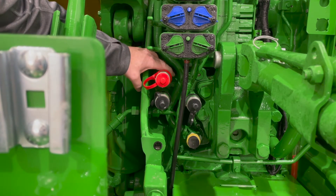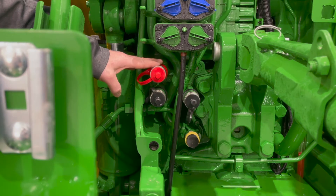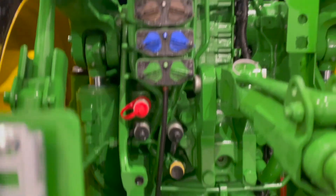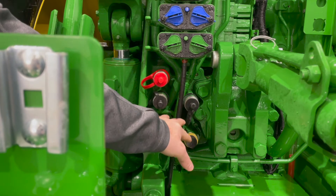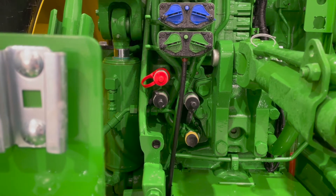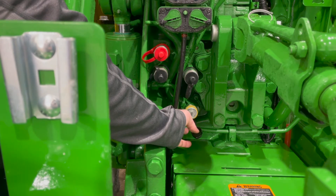Please note this one is equipped with only one pressure port; there is another port and another one could be added — you would just have to get the coupler from your parts department. Please note that your power beyond only has pressure when another SCV is activated or a load sense line, which is located up here, is plugged in. The lower two outlets with the black plugs located here are returns — typically we use those for CCS, VRDs, and IRHD. Located here on the bottom, this flat face coupler is called a case drain; it is used for motor protection return.